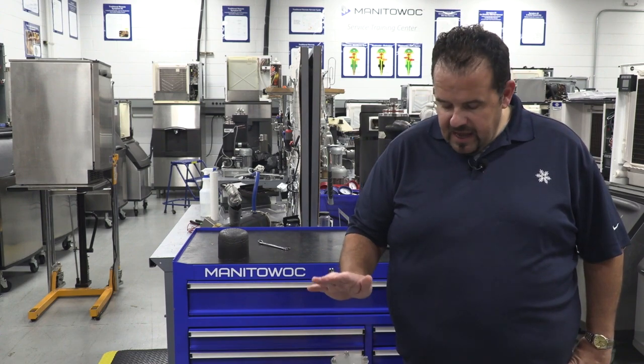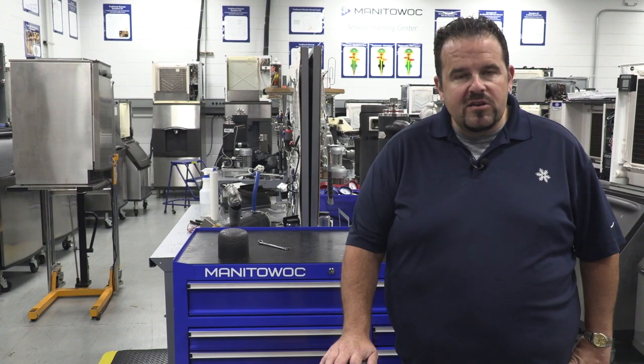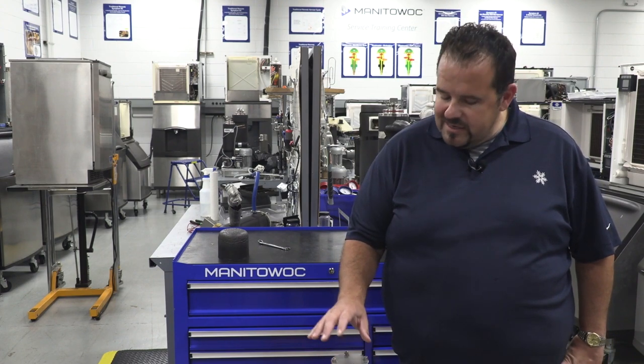So here we have one set up. Now it's not going to look quite like yours does because I've removed it from the cabinet to make it easy to access. Everything you see me do though can be done within the cabinet of this machine and the auger removed nice and easy with the bolts on the bottom and on the top. A lot of augers are very difficult to take apart in the industry, but this one is nicely set up.